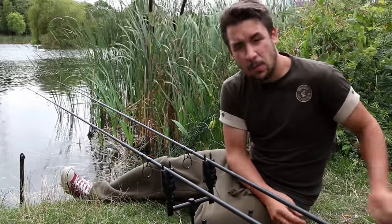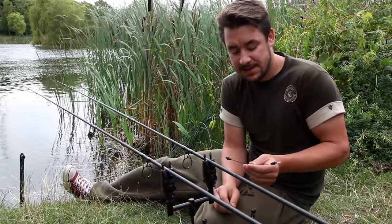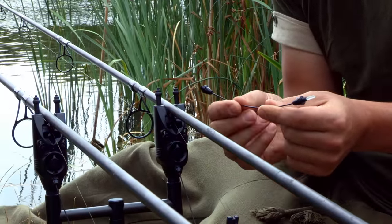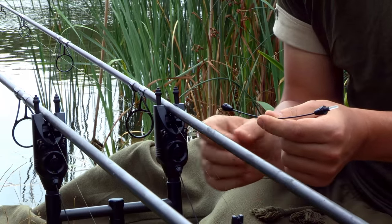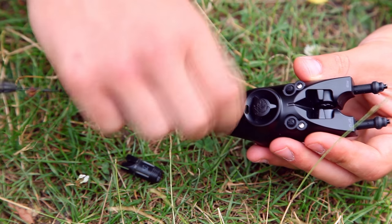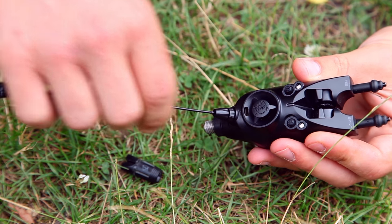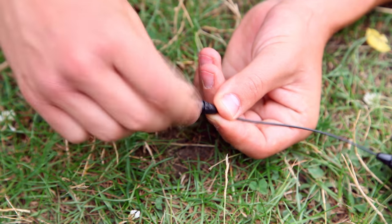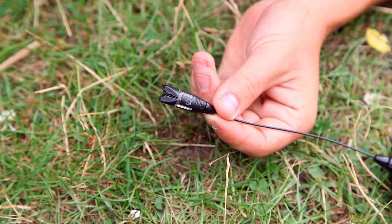One additional product that works in tandem with the R3 heads is the Optics light pipe indicator kit. This is a fibre optic indicator cable that works in tandem with the R3 alarm head. It threads into the base of the alarm where the embedded LED is, and that LED pulses through the fibre optic cable and lights up your indicator head in tandem with the alarm. So every time you get a beep, your indicator head pulses also.